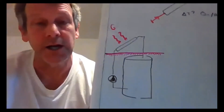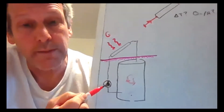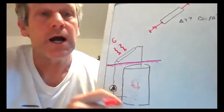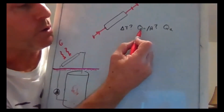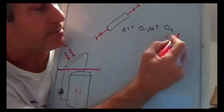How well is it going to work? I'm reminded of coaching basketball — there was always talk of a better offense to run. There are advantages to different offenses, but a lot depends on the components you select and how you link them together. Same thing here. How big a tank do you use? What kind of fluid? What pump rate? The crucial thing is to get the pump rate so that the water through the collector achieves turbulent flow — that's essential. And what type of collector? The questions we want to ask are: what's the delta T as fluid passes through, what's the rate of energy collection per square foot, and what's the overall rate in BTUs per hour?